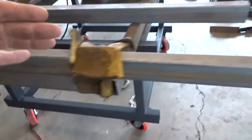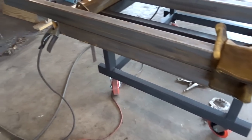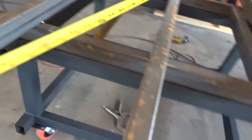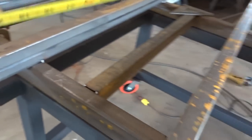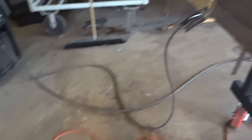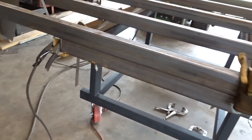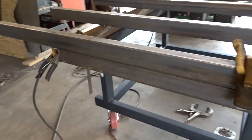Now I think I'm going to work on getting the rear hitch mount and support. One thing to keep in mind — if your frame underneath is square, all you have to do is measure out from underneath. Every one of mine was 17 and 8 underneath, so that's how I did that. Pretty simple — you can go down, make a mark on the frame, and just follow that mark wherever you put one. Easier layout than that you can't get — just zip, zip, zip and it's done. Most of this stuff is fairly lenient as far as what you can and can't do, so let's get some supports off this so we can fabricate our hitch.